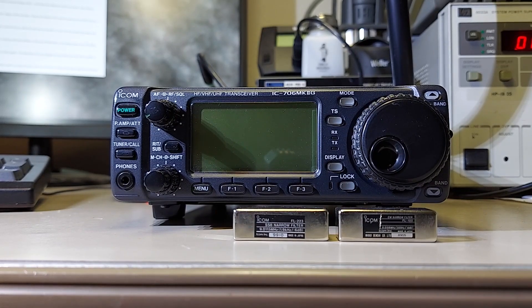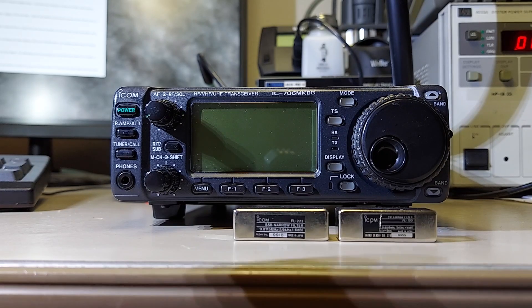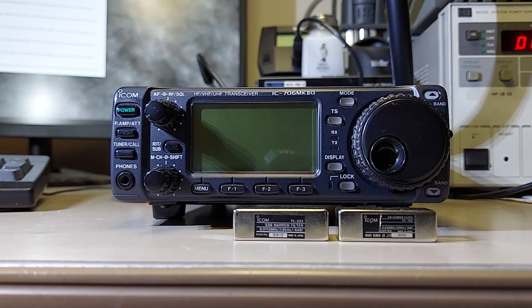This radio is largely stock. The only thing I've done to it is mod it for 60 meters. I did have to send it back to ICOM once to get an issue dealt with — you'd try turning the power on and the radio would not come on. It's a common fault on these radios; they have little adhesive pads on the bottoms of some of the boards, and that adhesive becomes corrosive after many, many years and eats through some traces. So this one failed — it wouldn't power on. I sent it in and for a fairly reasonable price they fixed it and sent it back to me fully serviced. So today we're going to install these filters and do just a basic bench test.